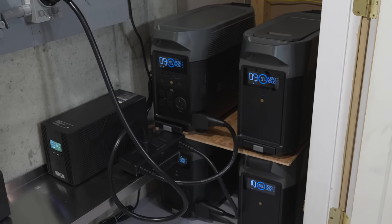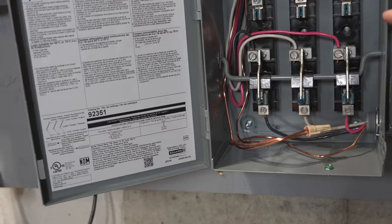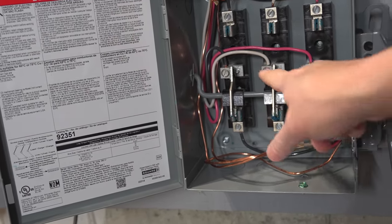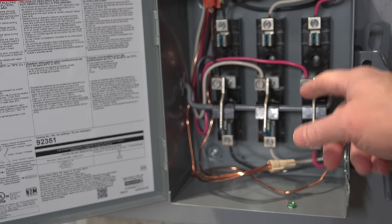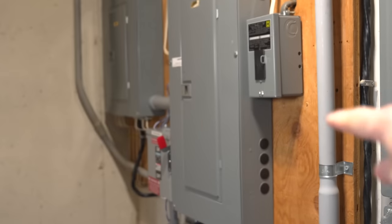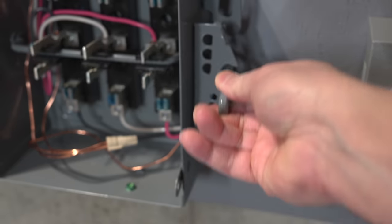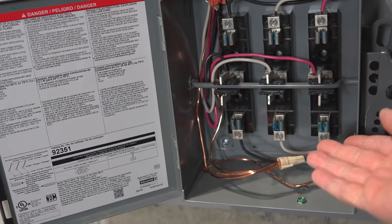A lot of you might be curious about this switch box — it's pretty simple the way it works. This is called a three pole double throw switch. Three pole means that I'm actually switching three different wires: two hots and my neutral wire. The center position is the connection to my electric panel, which goes up through this wire and connects into the interlock breaker. It's got a lever on the side and when I move it I break the connection to this inlet, and now I'm basically in the off position — this really is nothing more than like a Frankenstein switch.